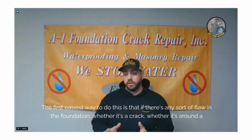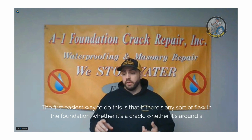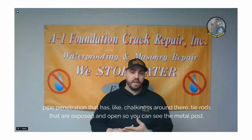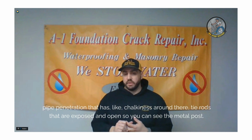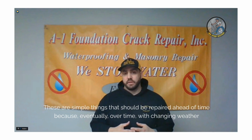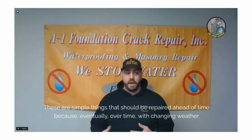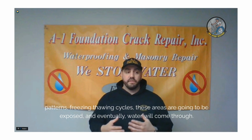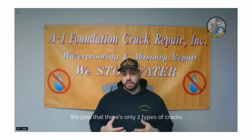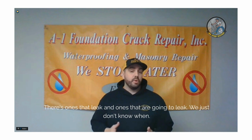The first easiest thing to do is, if there's any sort of flaw in the foundation, whether it's a crack, or around a pipe penetration that has chalkiness around it, or tie rods that are exposed and open so you can see the metal post, these are simple things that should be repaired ahead of time. Eventually, with changing weather patterns and freezing and thawing cycles, these areas are going to be exposed and eventually water will come through. We joke that there are only two types of cracks: ones that leak and ones that are going to leak. We just don't know when.